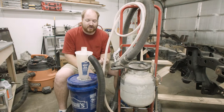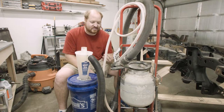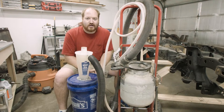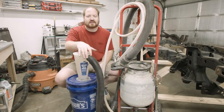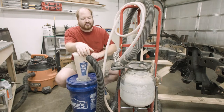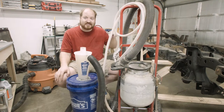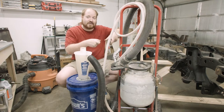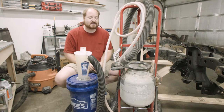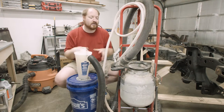As far as the dust — the finer particles that form as the sand hits the metal and breaks apart — I think the collection of that is extremely good. Sandblasting that area and a couple other test areas with the nozzle on really doesn't affect the air quality in the garage that much. The fact that I can sandblast in my garage for a couple minutes showing a demo without a respirator and just wearing normal safety goggles really says a lot. The amount of media that this thing blocks from ricocheting off of the metal is just amazing. In my week of testing this, I did pull the vacuum cleaner off and just held the hose next to the nozzle. I was only able to do that for a second and a half before debris was flying everywhere, ricocheting off of my face — I was wearing safety glasses. That just proved that having some kind of shield, which this collector acts as, really helps keep all that ricocheting material contained into one area.